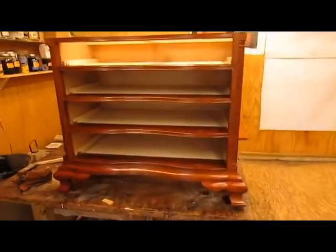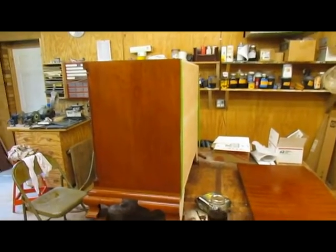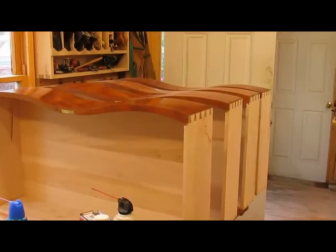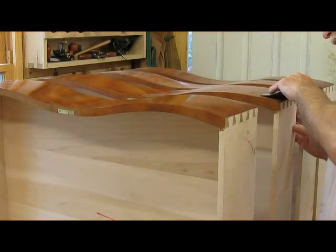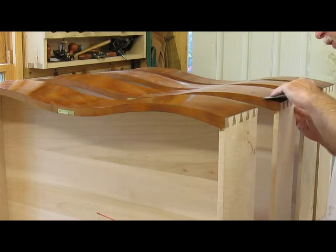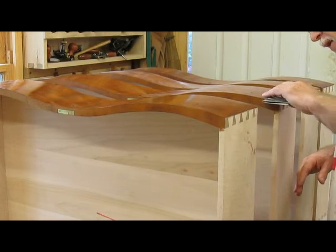Overall it's beginning to look pretty good. This has two coats on it as well, and the top back here has two coats too. It'll take six coats at a minimum to get it where I want it. I've got three coats on everything right now and I'm getting ready for the fourth coat. I've got some 400 wet-or-dry sandpaper here — between each coat I've been sanding the dust nubs off, and the finish tends to pool along the edges, which is pretty common, so you knock that down to make it even.